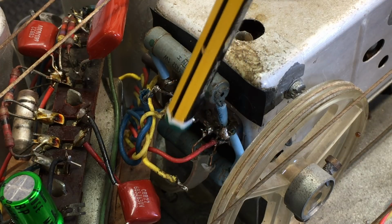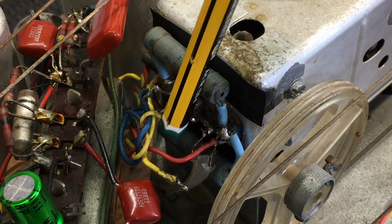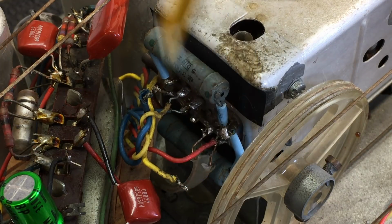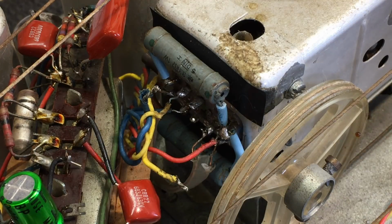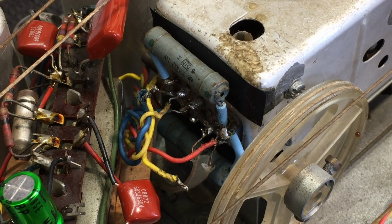The other wires are, one comes from that AGC line, and these two others come from the automatic frequency control, and there's one more that is actually the heater wire, because the heater ground for the tube is connected to chassis, and we have the heater wire coming in here. So all that's been checked. I've actually desoldered the AFC ones, because you can actually get this to operate without those two wires connected. It was doing absolutely nothing when they were connected.